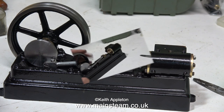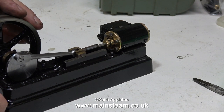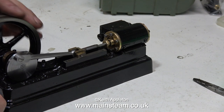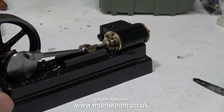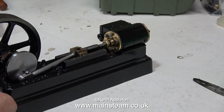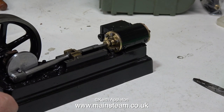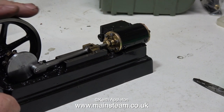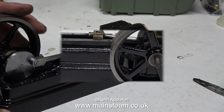I like to fit the crosshead bars last. I usually do it this way so I can see if there's any misalignment without having the crosshead top bars in place to obstruct my view. Everything seems to be perfectly fine. Really I suppose I could run this engine without fitting the top crosshead bars, but no, that wouldn't be a good idea. The cylinder, piston rod, crosshead, connecting rod and crank web are all in line.